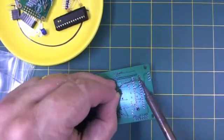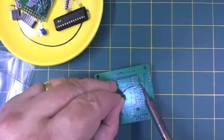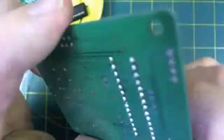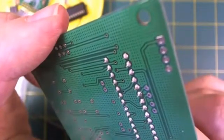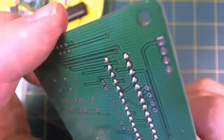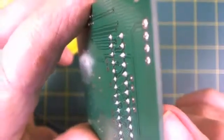Once it's flat and square, you can begin the process of going down and soldering each pin. Let's jump ahead after we have this soldered. Take a look at your soldered joints and make sure they look something like this — that they're slumped and kind of conical.